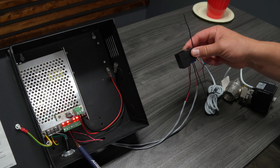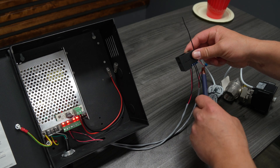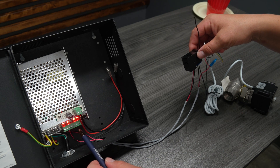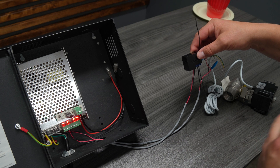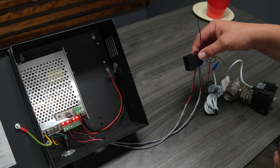With the other 12V DC output, the black wire goes through the relay, so we're intercepting the ground. The positive for the 12V DC output goes to the red wire on the water valve. In other words, when the relay activates, we're going to power the valve and it's going to close.